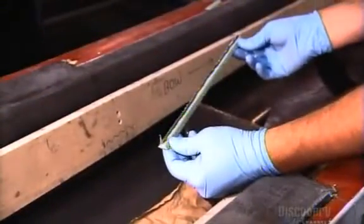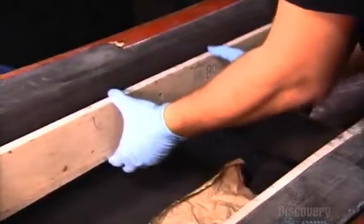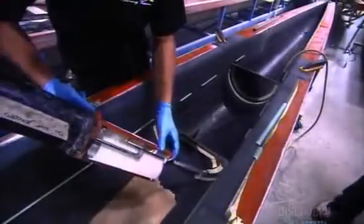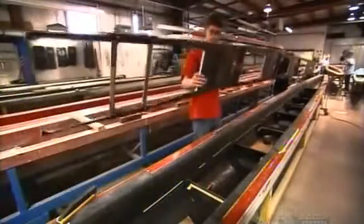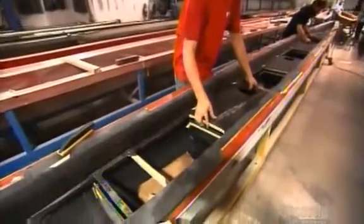They glue foam on the inside rim of the racing shell, using a piece of wood as a guide. They bead glue around the bulkheads. Then they lower the cockpit panel so that it adheres to the glued areas. The hard foam installed along the edges supports the cockpit.